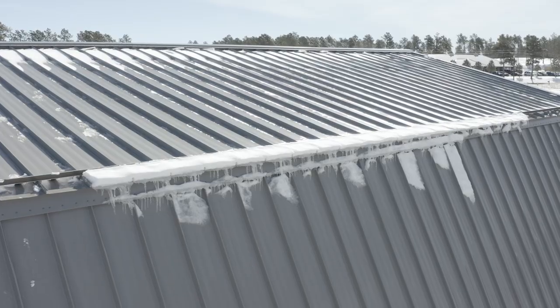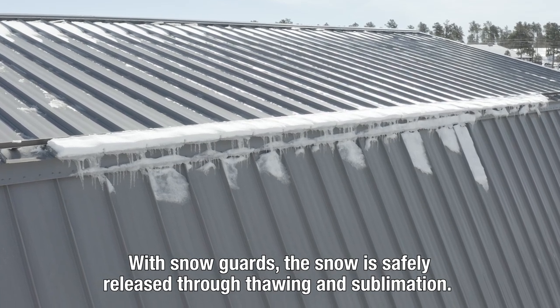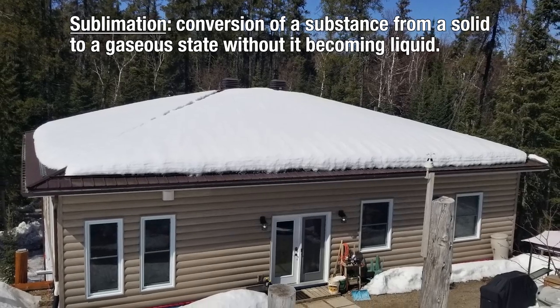How does it exactly help alleviate the problem of snow avalanches? The objective is to immobilize the snow so that it doesn't evacuate suddenly in the form of an avalanche. It does evacuate eventually through both sublimation and thaw. If it's thawing, the sunshine is still hitting that roof, warming it, and ambient air temperature comes up — there's a natural thaw process where snow turns to liquid water and evacuates as water. Snow also sublimates — that's a fancy word for passing from a solid state into a gaseous state without ever entering a liquid state — and snow does that even when temperatures are quite cold.